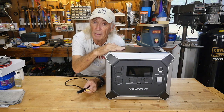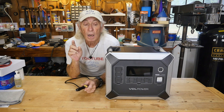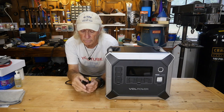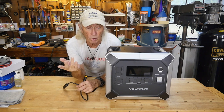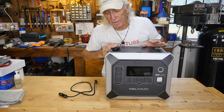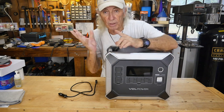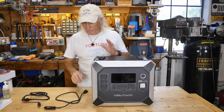I put in a heavy-duty cigarette lighter outlet when I ran my solar lines down. The XT90 connector on the side — bigger than the XT60 on the front — is for solar charging. It also allows you to run the unit while simultaneously charging from solar. The spec is up to 500 watts of solar input, with a voltage range of 11.5V up to 50V, so 12V, 24V, 36V, or 48V solar systems all work. You can charge from solar and draw power off the other end at the same time.